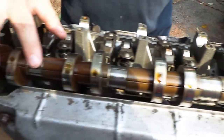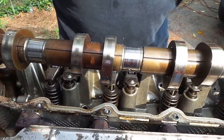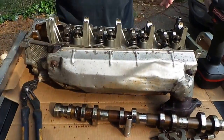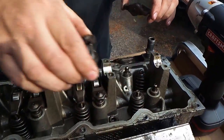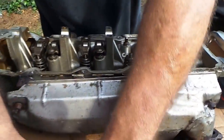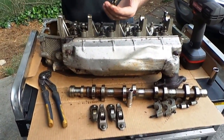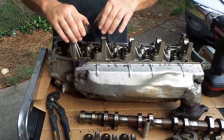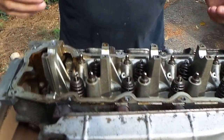The cam - once again you're looking through here, making sure you know what you got. Just take a little bit of cloth on that and clean it up real nice. The cam, there's no way to screw it going back on - when we rebuild it I'll teach you that next. You have the rocker arms now - they're not numbered, but I always just for general purposes keep them exactly like they came off. You can look underneath them and see if you see anything peculiar. Very rarely do I see bad rocker arms so I don't sweat it too much.